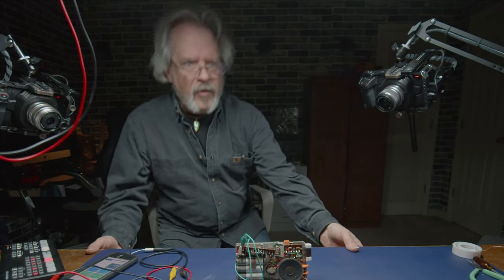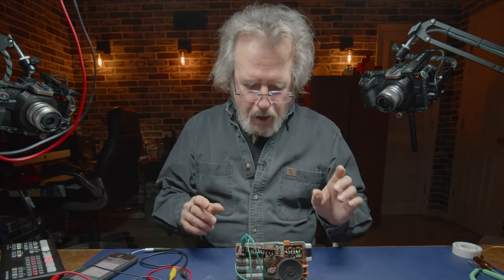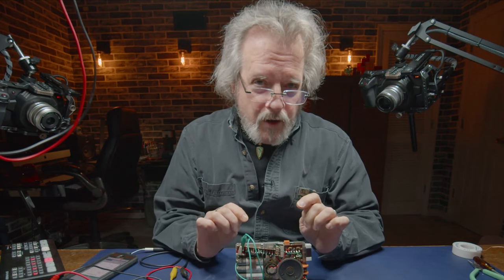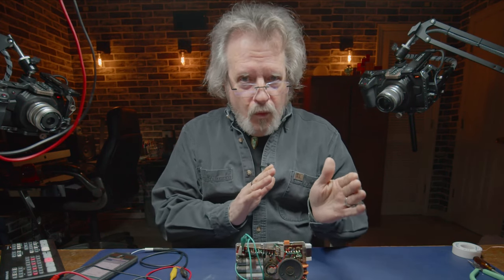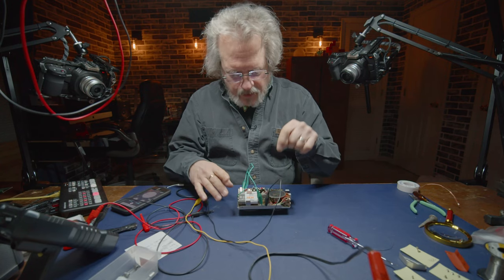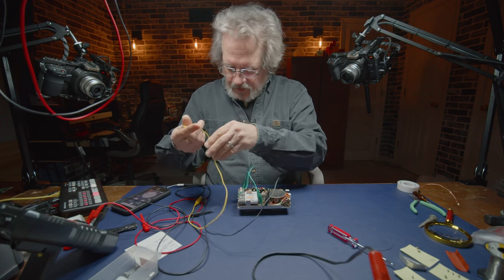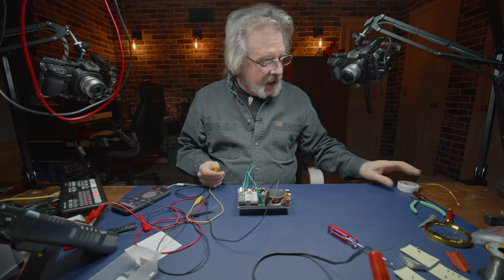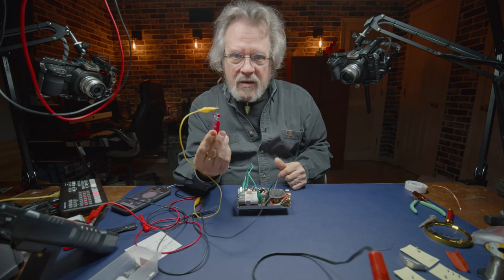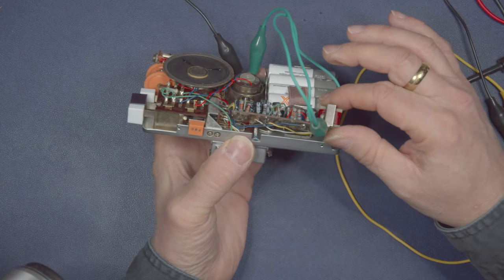All right, I had a thought - why don't we try injecting some signals through the amplifier card, just to see if it's totally dead or what. I've got the phone grounded to the tape deck, and I'm going to be using this alligator clip coming off the hot lead from the headphone output to use as a probe for injecting signal.